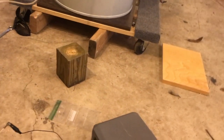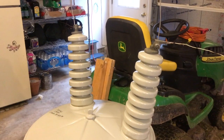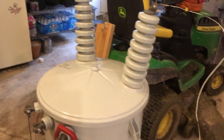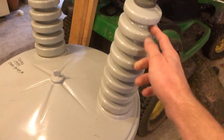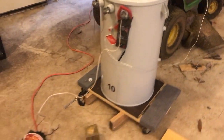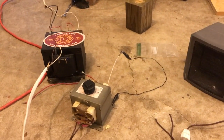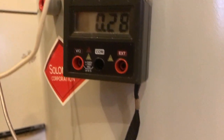It's not the case when it's connected in a grounded configuration. So I just ground this terminal here out — H2. I was on a road trip recently and the power company in New Jersey was putting H1 live where this is supposed to be H2, connecting the live there and grounding that one out — not right. So with that grounded, I'll plug it back in. No ballast, so — even if there was a ballast it probably wouldn't do anything. As you can see, it's almost at 0.3 amps, 0.28.